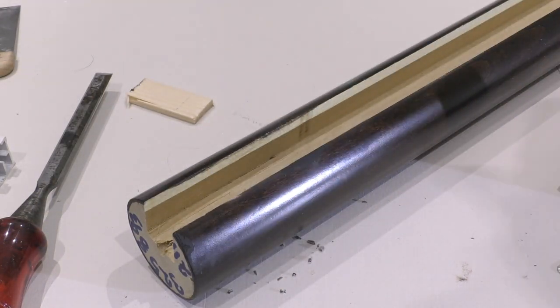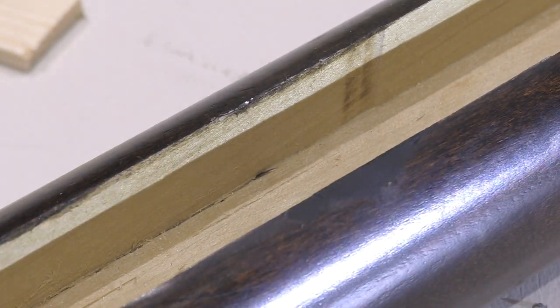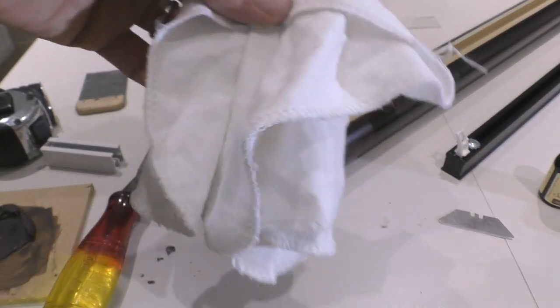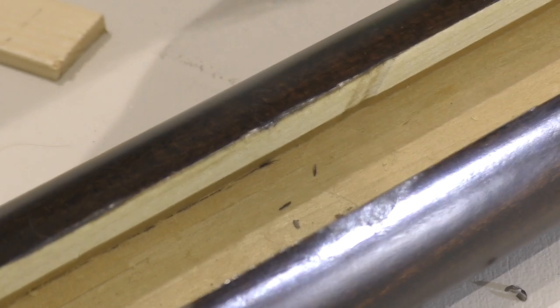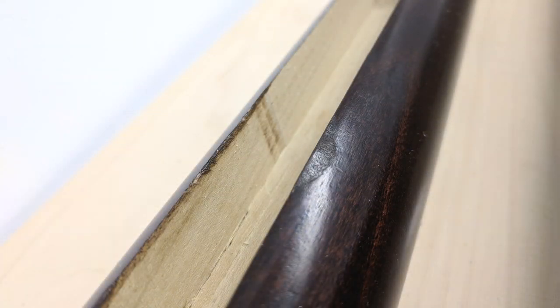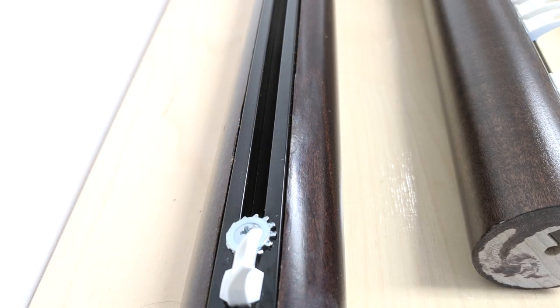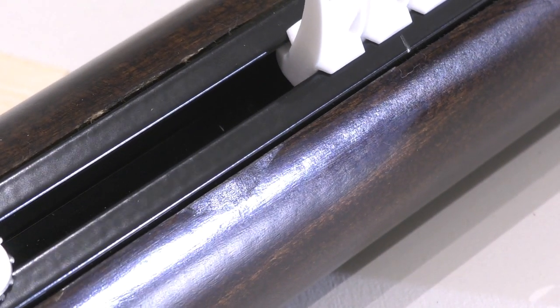So the liquid scratch cover has now gone off. You can hardly see it — it's just there, look. Using a lint-free cloth, which again you can pick up at DIY stores, I'm just going to give that a buff now. There you go, the repair is finished. So it's not as good as you'd get if you were a French polisher, but I'm not a French polisher, and I'm pretty pleased with that. So now I can put the track in place, screw it down and continue with the job.